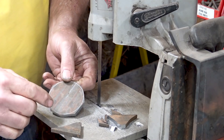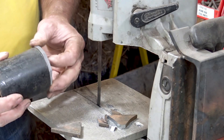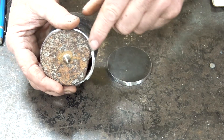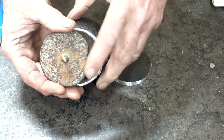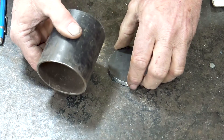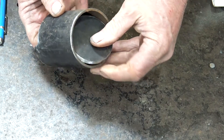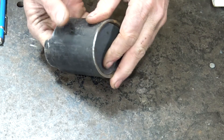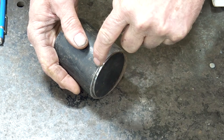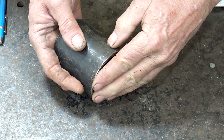There's the piece that will become our bottom. We'll just need to grind that around there and test it as I go to make sure it's actually going to fit. Here we are cut out for the lid - that'll go on like that. There's still going to need to be a little work here. I want to flatten this out so it actually matches this profile, but I don't want to flatten it all the way down to the bottom because I want to leave a round bottom, which is where our bottom will fit into. It fits pretty nice. We will blind rivet this in - probably six or eight rivets, and that's mostly for looks.